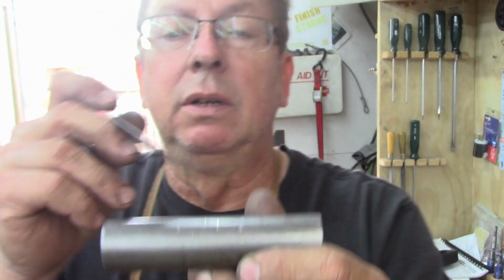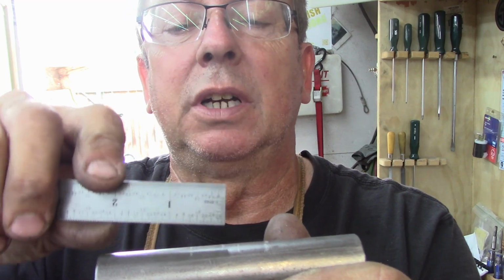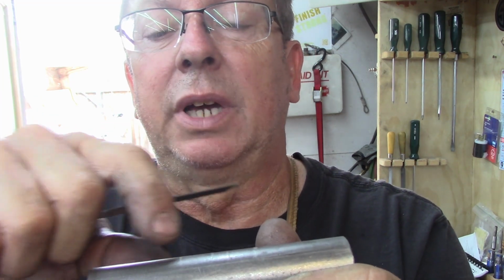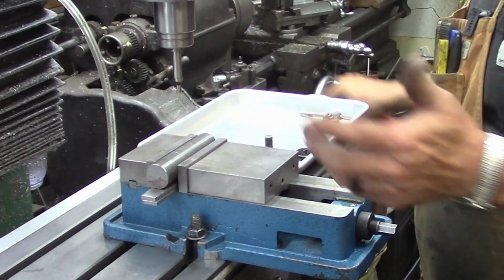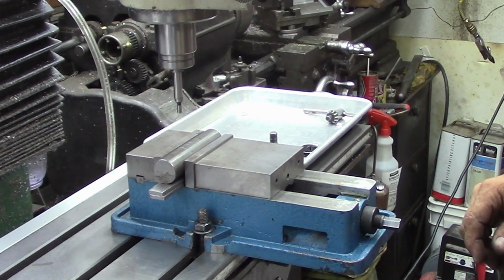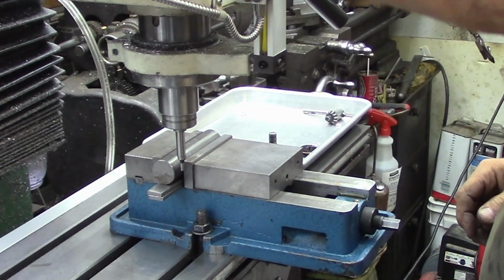So we're going to part it in the center there. Those will be our tops, so we'll have room to face those off from. So this will be the very top here, and this will be the very top on this one. To the center of our hole from the top is 1/2 inch. So that's where I came up with that 1/2 inch dimension. So we're just going to do 1/2 inch there, 1/2 inch into there. And these points, even though we've measured them out, they're basically arbitrary. It doesn't matter that much in the big picture of things. That should give us a pretty good indication of where we are.